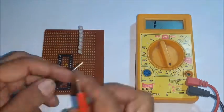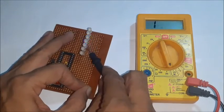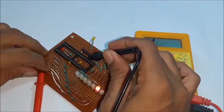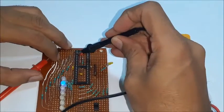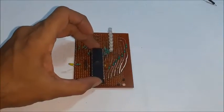Check all LEDs using a multimeter in continuity testing mode, holding the common and each color lead. Now solder the resistances as shown in the circuit, and once again test all the LEDs with respect to the 40 pin IC base. Use a hot glue gun to hold the resistances properly in place.